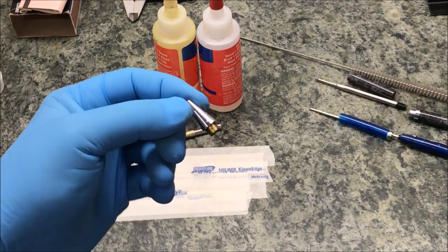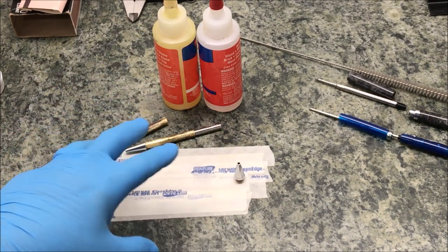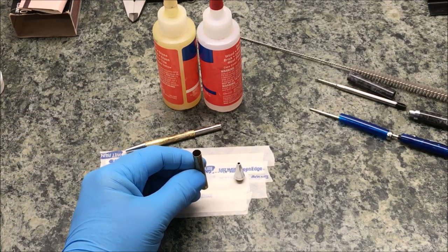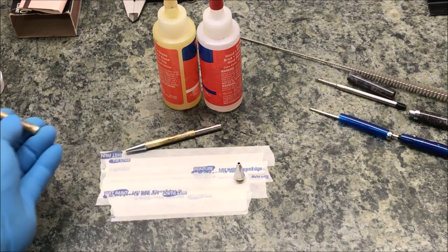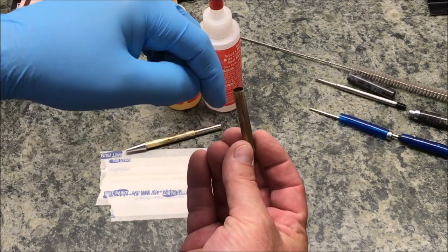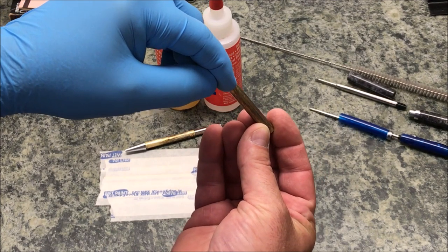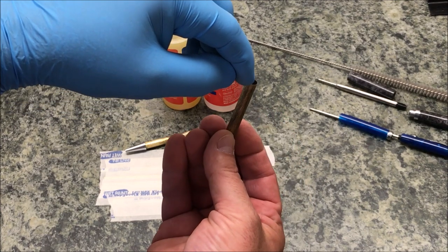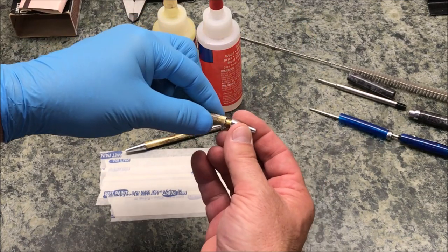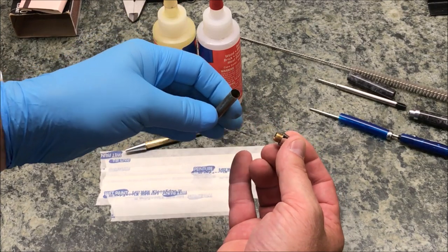With my son's pen, the nib popped right out while I was cleaning it. I think what happened is a learning experience from years ago — when I first started making pens I used a barrel trimmer. I'd drill my hole, set the blank aside, and come back later to barrel trim them all. If you didn't line the blank up exactly the way it was drilled, the barrel trimmer didn't go straight down and wallowed out the end of the tube, making for a very sloppy fit. You can see I can push the blank all the way on by hand.